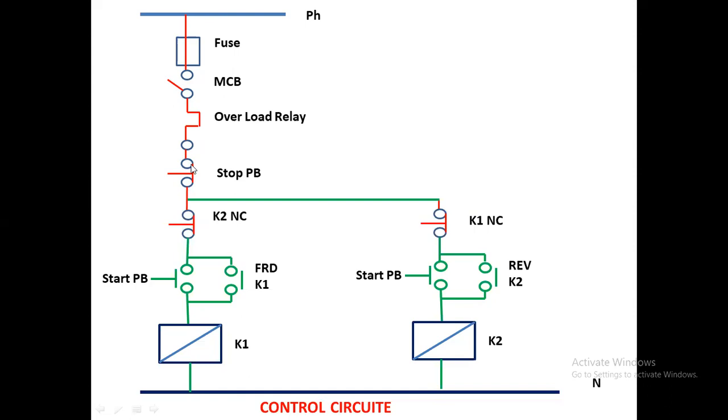Next, we have the forward contact and reverse contact. For the forward contact, we use a forward ON push button with a latching circuit. Similarly for the reverse contact, a reverse start button with a latching circuit is used. This is the DOL circuit — you can refer to our previous DOL starter video on our channel. When the forward button is pressed, the latching runs the forward contactor. The NC contact of the forward power contactor must be connected at the start of the reverse push button circuit.